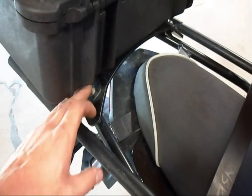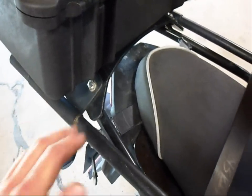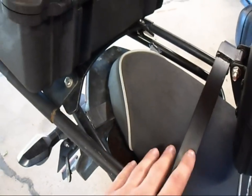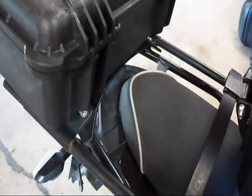Another tip: if you do this, leave these bolts loose. Put all four of them in, but leave them loose. Then have someone slide this backrest in and out while you slowly tighten them, and it will kind of self-align.